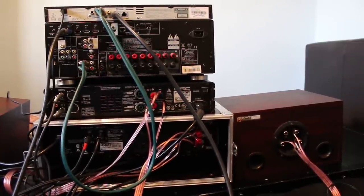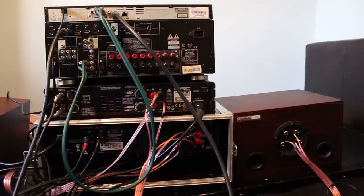I mentioned that this particular setup falls into tri-amping. Tri-amping is usually done when one set of speakers has a tweeter, mid-range woofer, and subwoofer built in, and then you use three different amplifiers to drive the high frequencies, mid-range frequencies, and lower frequencies. For this demonstration, I'm using two Tannoy Senses C speakers and I'm going to use the external amps as described.